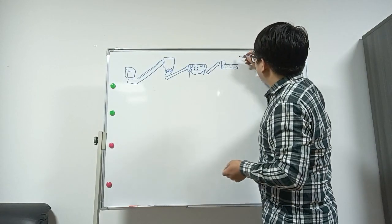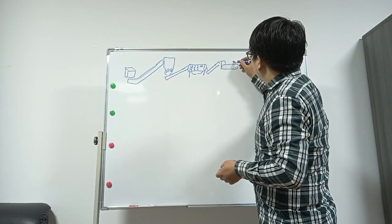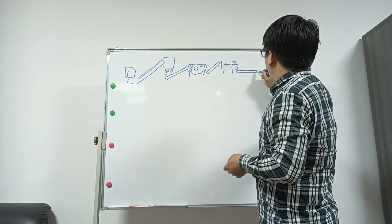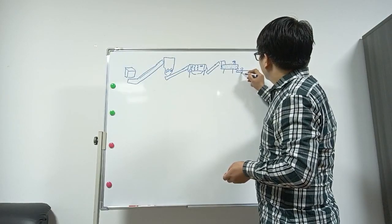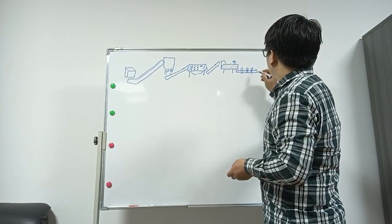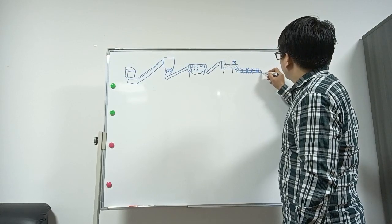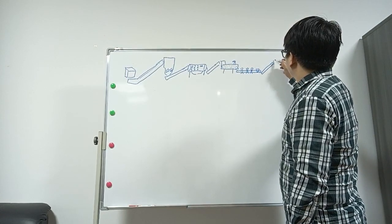And for the dry type, there is a blower to separate the labels. After the labels, there will be a sorting table. Sorting table means a person is needed here for manual sorting. Of course, there is a metal detector to reject metals before the crusher. Then belt conveyor into the crusher.